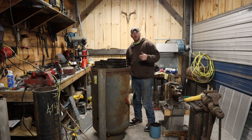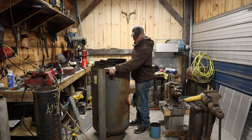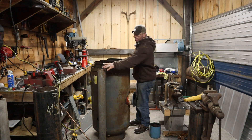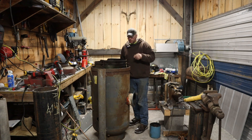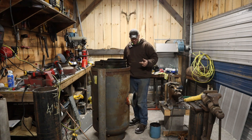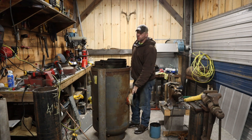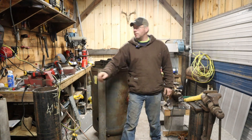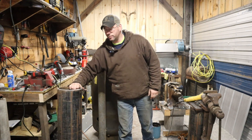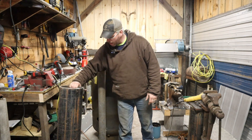So what we're going to do — a couple of things. I need a bigger exhaust, so we have a piece of four-inch exhaust pipe right there. We're going to square this end a little bit, and that will become apparent why a little bit farther along. I'm going to cut this piece off right here — this is stainless, that's why it wasn't welding very well. Over here I have another piece of eight-inch schedule 40 carbon steel pipe.